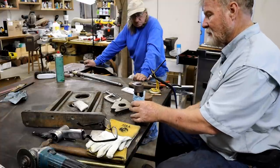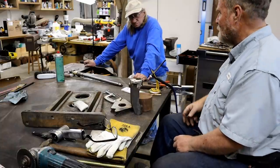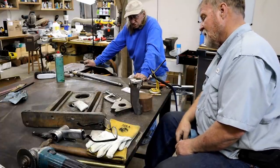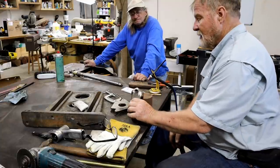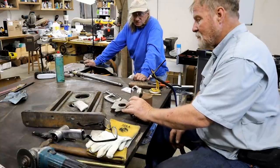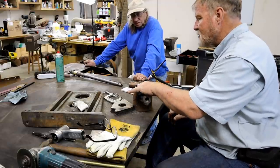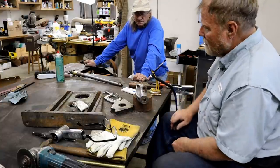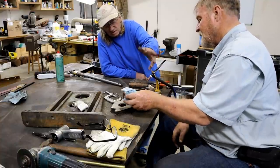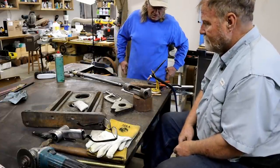I don't know if we talked about it, but I call this not so much TIG welding, it's metal sculpturing, metal molding. Shows you what you can do with it, though. You can get that hot and it stays without cracking. That's a winner. And just rebuild the area with it. That's all I'm doing, I'm rebuilding stuff. I'm cutting junk out of there down to bare base metal, and then rebuilding it. I just like this method better because you can shape it, and it looks more natural. Shaping it up? Yeah.